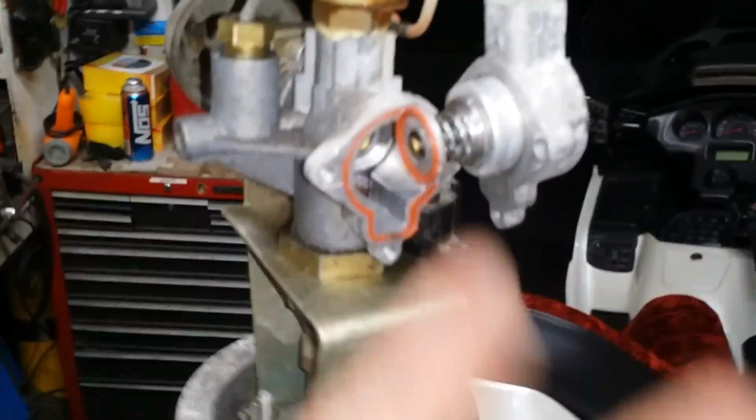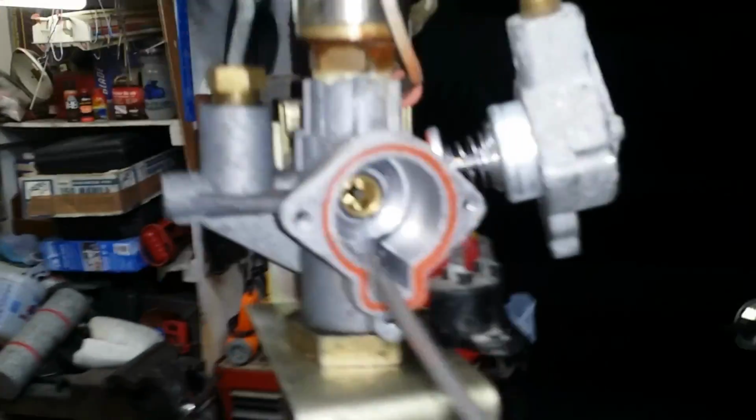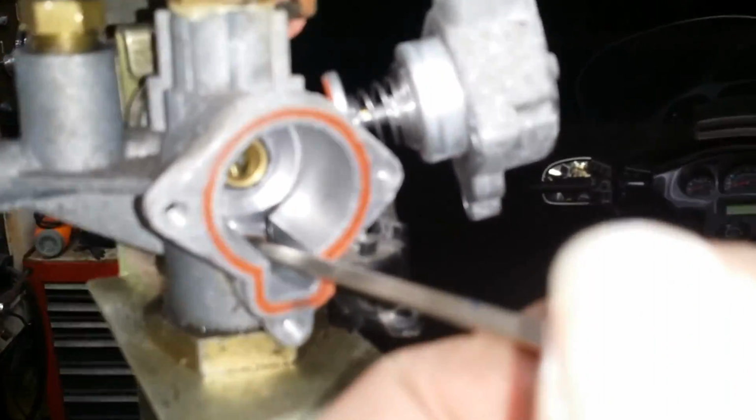Well, when you press and hold it long enough, there's enough electricity in it that this little magnet in here actually gets held on. Well, if you bypass this whole spring and valve mechanism, then what happens is that the gas bypasses from the bottom hole down here, which is where the pipe comes through. It comes through here, through this, and into here, and up through your jet. So it comes down through here, and then into here, which goes up through your jet, and this is your main jet down over in there, okay?